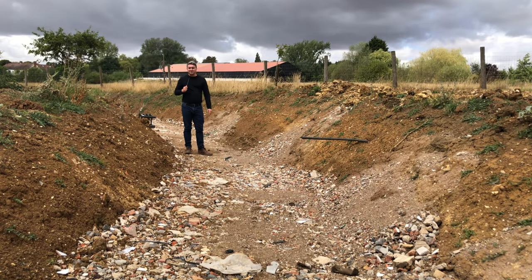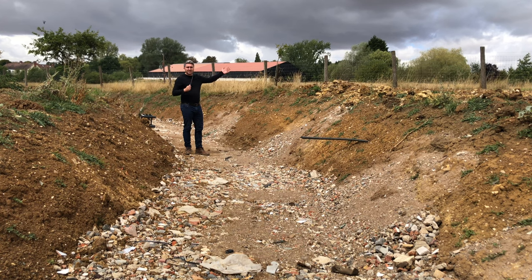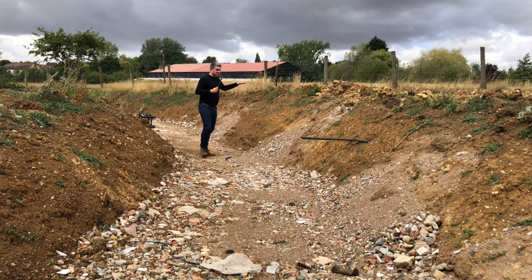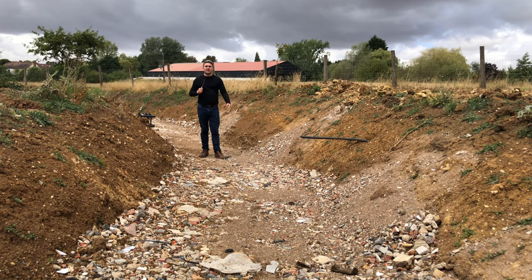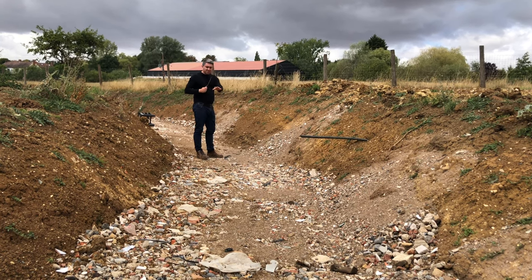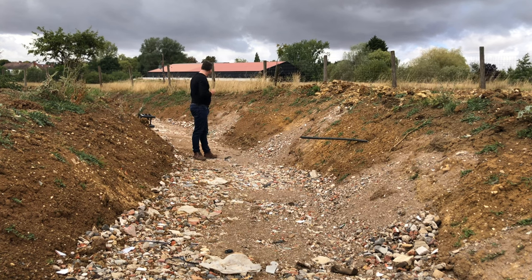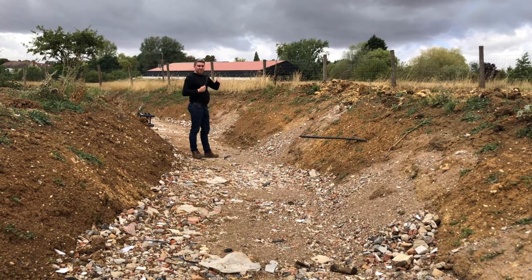Welcome to the location of the tunnel. The plan is to have two brick faces at either end with a corrugated steel roof, which will go across the cutting with sides to hold back any earth, and then we'll backfill on top so it's all covered up. It'll only be about three metres but it will be a nice feature — just something fun for the train to go through. At the base of the cutting we have drainage all the way through, land drainage, and on top is rubble filled back up to the required level. On top of that will be crushed concrete for a firm base, and then the track goes on top with ballast.